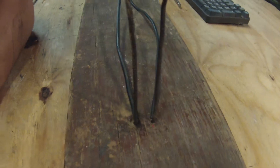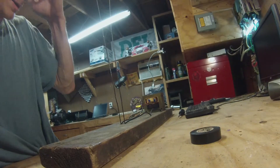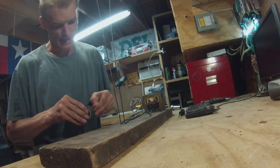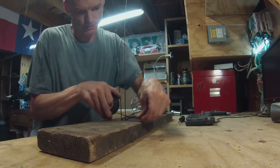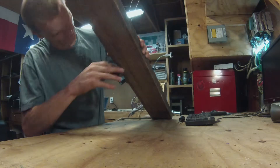Let me show you what's going on here. I've got the probes down in the holes — basically just shoved the wire in there and the probes make contact. Wires leading back to the secondary lead and ground, and our power cord connected as shown before. The last thing I want to do is keep these things from sliding down, since the holes go all the way through the board. I'm going to wrap this in some electrical tape, which will melt a little bit in the process of firing it up.